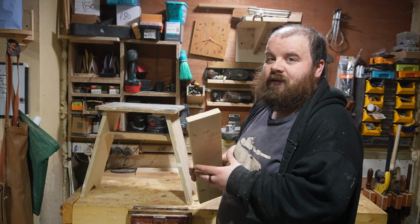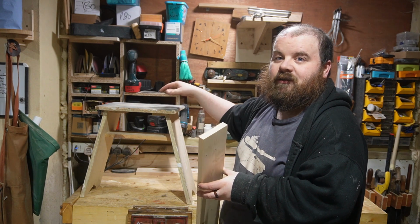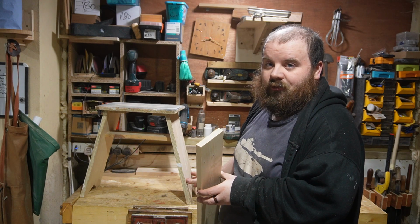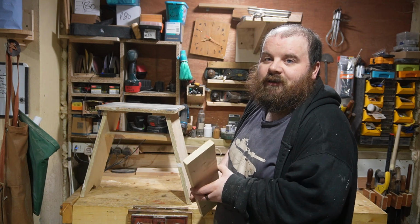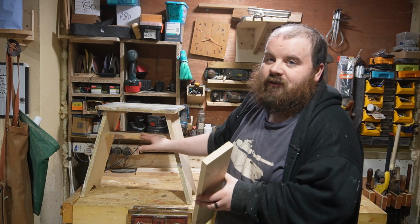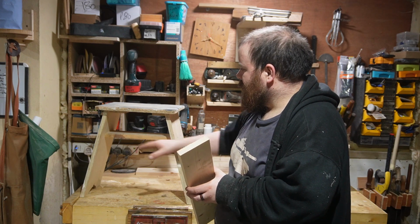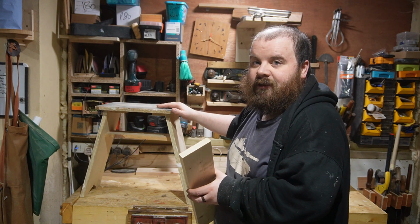of one length. You're going to need three 350mm long pieces to make the top, 4 440 long pieces to make the legs, and then you're going to need one 320 piece to make this little division here, the stretcher that serves the purpose of you have to put stuff in there if you have to, and also strengthens up the legs.